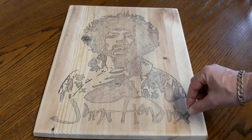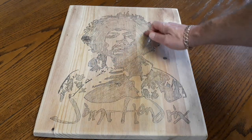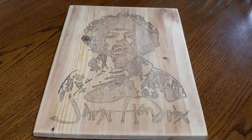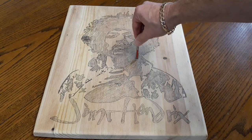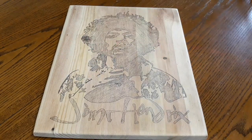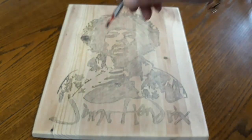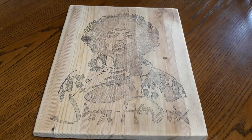I'll keep the CNC bit for smaller areas, but for bigger areas like the hair I'll put on another bit — a quarter-inch double-sided bit, basically with a blade at both sides. That will whip through the larger sections no problem, but it's too big to fit in the little areas. I also like the one-eighth bit — that's a single blade — again too big for the tight spots but better for the medium ones. So that's our three bits covered.